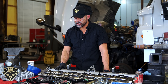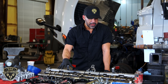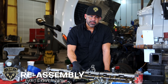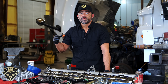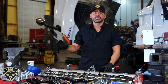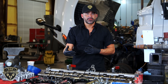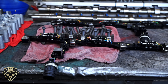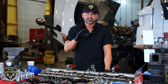Since we're talking about injectors — when you put all this back together and put your cams back on, make sure they're timed using the right equipment. Go ahead and put the rocker assembly back on and do a valve adjustment before installing the injectors, because when you're doing an adjustment you have to rotate the engine. It's not a good idea to rotate the engine before fuel has made it up to those injectors — the fuel system is dry, and when you rotate the engine to adjust the valves and jake brakes, you're forcing air into those injectors, which can possibly cause damage.